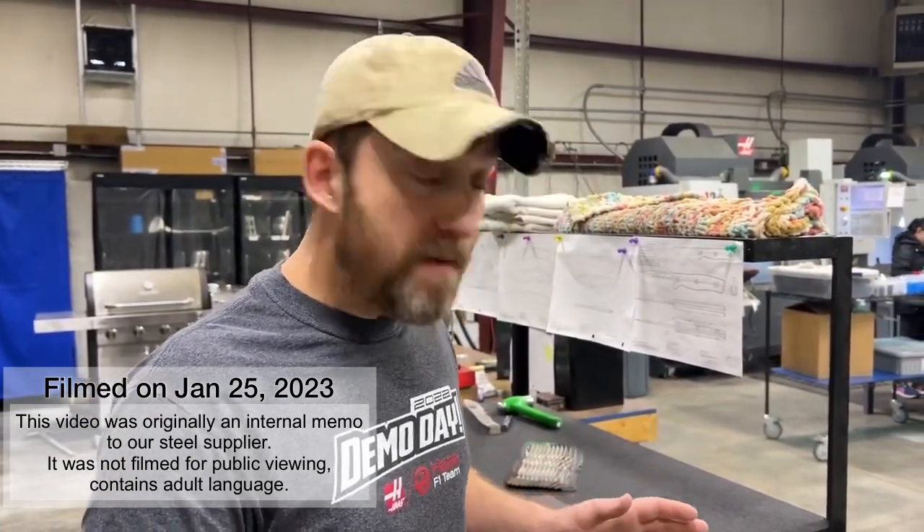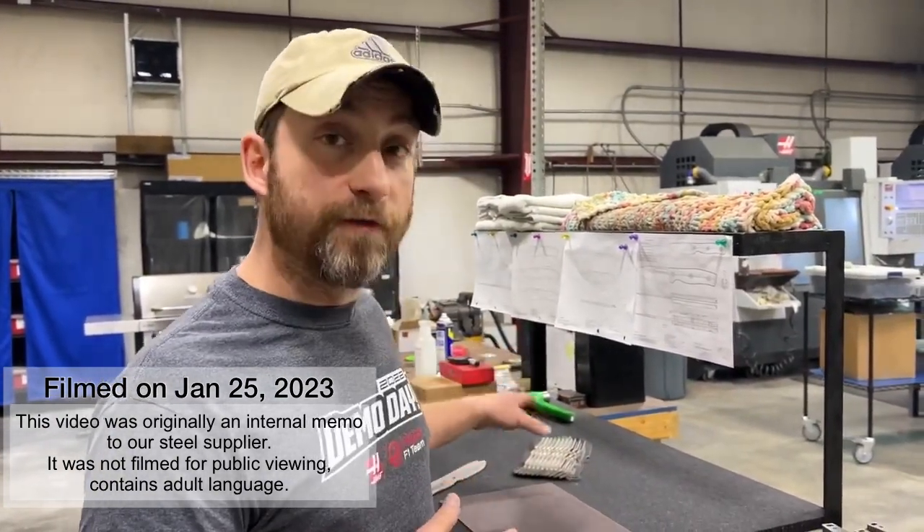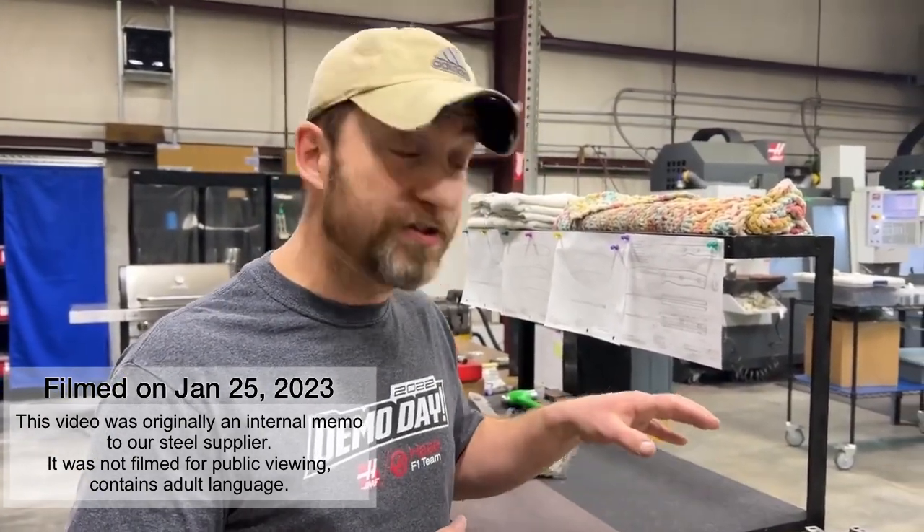I tried, but when I got to finishing, there's still decarb all over the place, and trying to flatten these takes me 45 minutes to an hour — with the bigger, thicker parts that are a bit easier. This is going to get further and further exacerbated the smaller and thinner I go. These parts are jacked up.